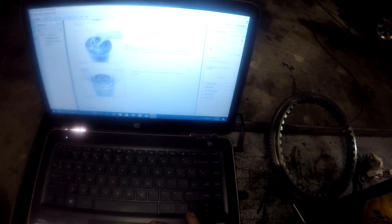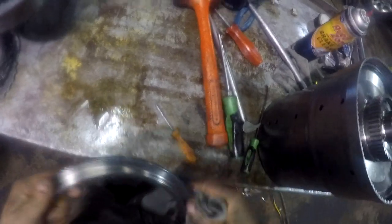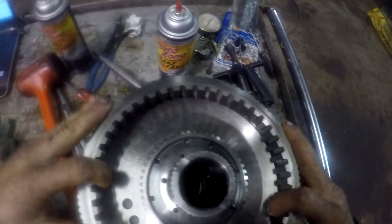Insert disc carrier K3 into the spline tube until contact is obtained. Gotta look this thing over. Is this directional, or doesn't it say on there? Looks like it's about the same shape on both sides. It's not directional. We're going to put the part number facing up. Boy, these ring gears are snug fitting. Wow, they are tight fitting. They don't just slide down in there. The power shifts and you go clunk, away you go.